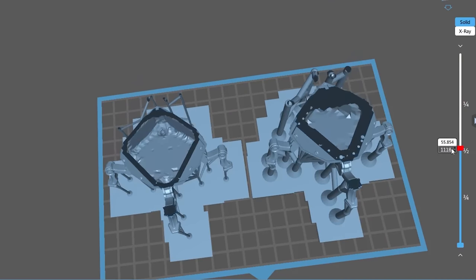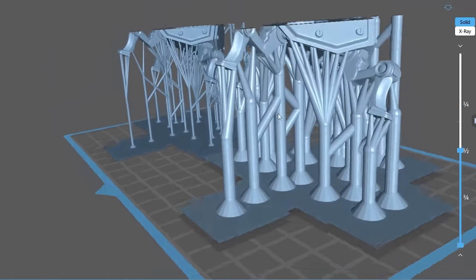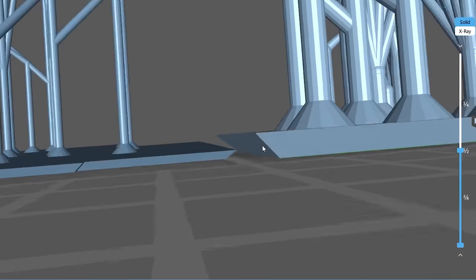Today we're going to show you how to take a 75mm scale model and scale it up a few sizes, so you can understand the processes that succeeded in our tests. The first option is the simplest: just take the hollow model with support and increase the scale for printing. However, this generates a piece with thicker walls, support, and raft that are much more rigid and thick, which will mark more and use more resin.